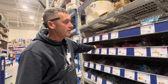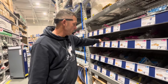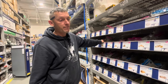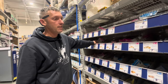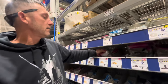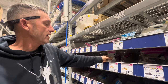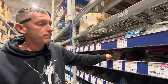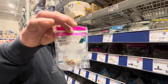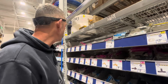You can either use PEX shark bite clamps or quick connects, which we'll show in a minute. You need to figure out the length you want — all of ours is basically half-inch. We used half-inch PEX and hard piped it in. You'll need some elbows for your 90s, because when you come out on your low point drain you're going 90-out to the back of the RV for your connection — two for hot, two for cold. They're $5.98 each.